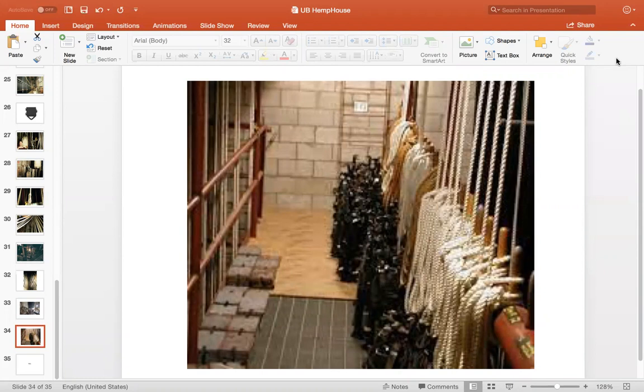One of the things that people forget about, and in the bigger house, it's a problem. This one, I don't think it's going to be a problem, but in a house with a lot of weight, they'll stack all of the weight on the onstage side of the loading bridge. When they designed that loading bridge and the engineers figured out its weight capacity, they weren't taking into consideration just the onstage beam that's running upstage, downstage, that's holding that thing. They took the two beams, but now you're just loading up everything on one side. And we've been in theaters where we've seen deflection in that onstage I-beam that's holding up the loading bridge because it's just got too much weight on it.